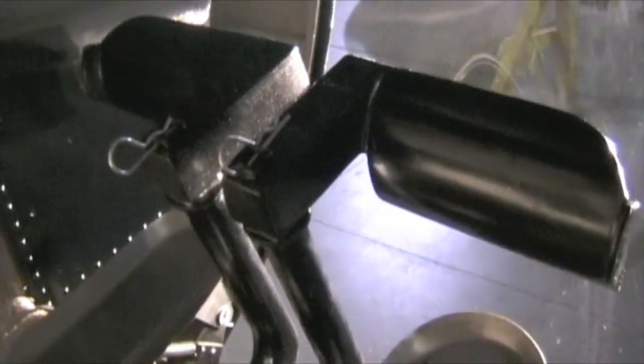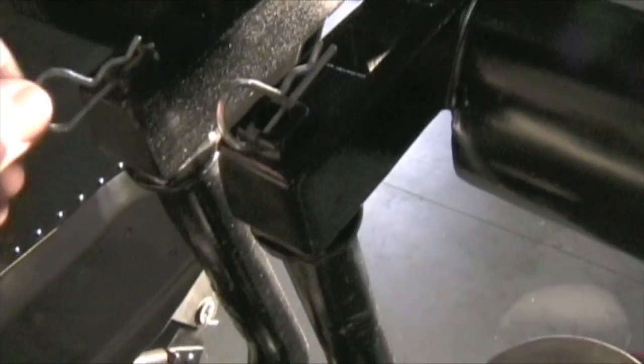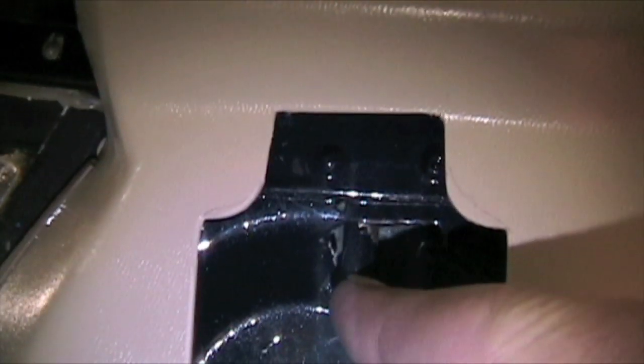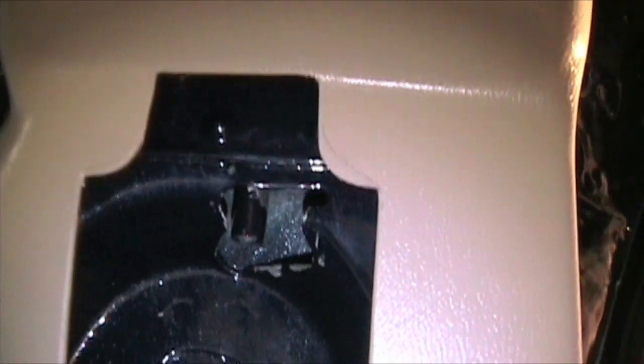Everything's looking good. Here are the right set of anti-torque pedals. You can see these cotter pins — you can take them out and adjust the pedals depending on how short or tall you are. Make sure those cotter pins are installed if the pedals are installed. Starting at the pedals on the right side, come over to the column along the door. This is the bottom pin for the right door — make sure that's all the way down. Coming up, here's your top pin — make sure that's all the way up. If these pins come out, there's a good chance of this door flying off, so definitely make sure those pins are fully installed.